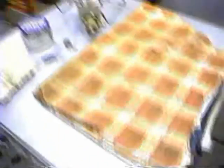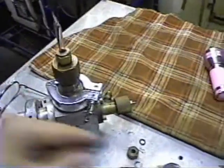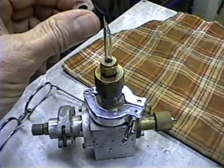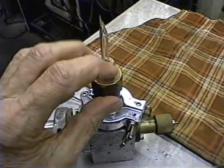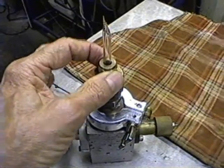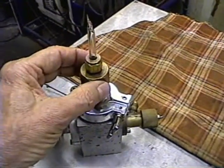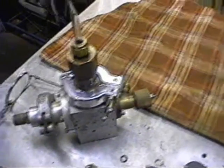So that is what we use for producing the vacuum. To connect the tube onto the vacuum system, we use a little fitting that uses an O-ring. We take an O-ring and place it onto the evacuation stem, and then we have a clamp nut that squishes that O-ring down. The socket where that O-ring fits is tapered so that as the clamp nut clamps down, it squishes the O-ring onto the glass and onto the threaded portion, forming a vacuum-tight seal. That makes a very quick and easy way to change out the tube. We can change out adapters by simply using K-clamps — standard vacuum K-clamps available on eBay for $10 to $15 each.